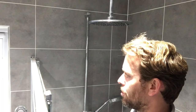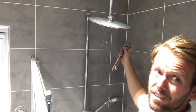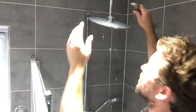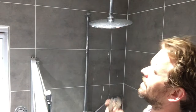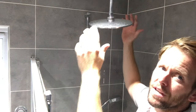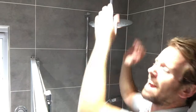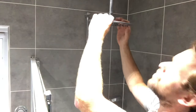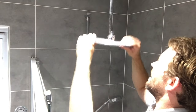Here we are in the shower, and here's our little joint on top that we need to take it away from. All you'll need for this job, really simple, is a pair of adjustable spanners. We'll locate the two little flanges. You will get a bit of residue out of this. Give it a little tweak and then it'll become loose. It won't be very tight because it's on a rubber washer — you don't want to tighten these really. I just use hand tight to keep it tight, because otherwise you can squash the washer and it'll start leaking through the top. So unwind that and out she comes.